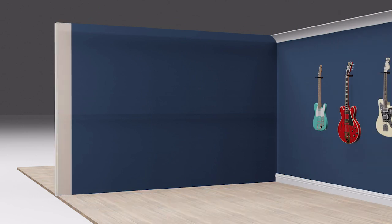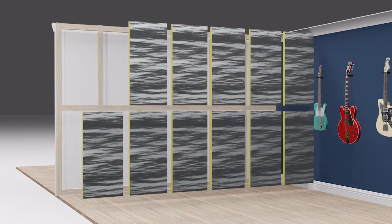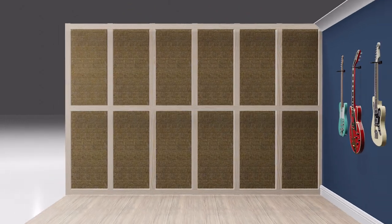There is a slight difference in how we prepare and install wall soundproofing for a stud wall versus a brick wall. For a stud wall we always need to remove the original wall surface. We need to access the cavity space — if we don't, the cavity space will create what's called the drum effect, where sound reverberates inside a space and is amplified, making the original noise even louder and harder to block. Only acoustic mineral wool can prevent this; you can't leave a cavity space empty or with thermal insulation because thermal insulation hasn't got acoustic properties due to its low mass.